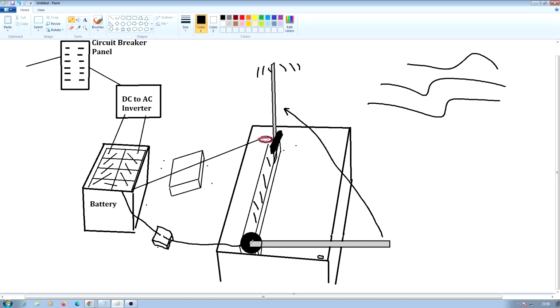So you have to position your mechanical arm so therefore it hits all of them at once. And as it hits all of them at once, you would have to have a switch that hits the switch while it hits all of those aluminum poles at once. That switch should be connected to a motherboard or something, right? That's connected, and then monitors whether that switch has been hit. If it's been hit, it sends a signal to the motor to reverse the rotation of the motor, go back to its position, and hit this switch.